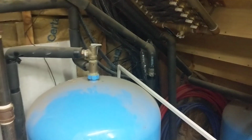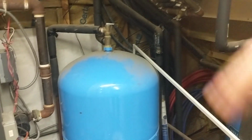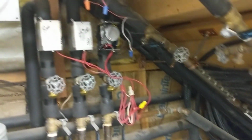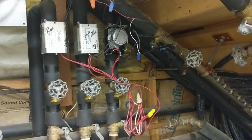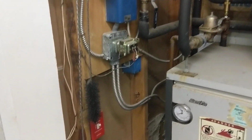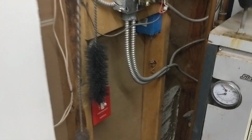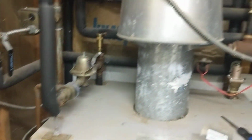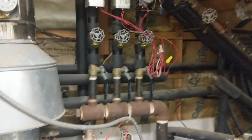The hot water heater is this tank over here. Hot water gets fed into a coil inside that tank, and the hot water flows around that and heats it up. So we'll walk through replacing that hot water portion of the valve right there. First thing we want to do before working on any of this is to find the red outlet, which is the shut-off power for the boiler. We're going to flip that off, so that when rewiring, we don't short out anything or get shocked.